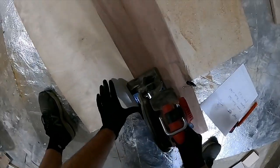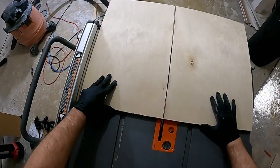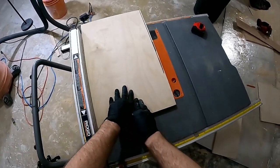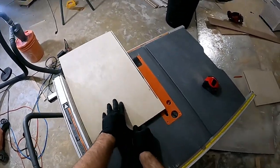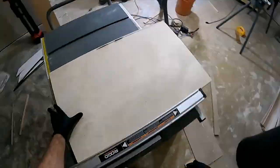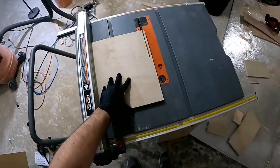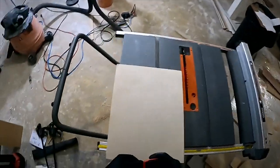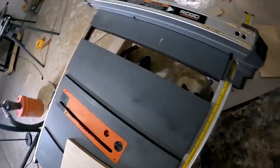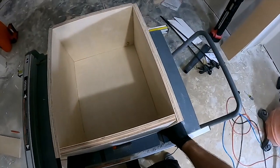Before I bought my track saw for cross cutting, I made a circular saw guide - check out the short I made about it, linked below. I used it to get close-ish chunks that I could then run more easily and accurately on the table saw. It's double the cutting but definitely better quality. My tools are not really cabinet-making grade tools, so I came up on these cuts twice - first to get pieces to a manageable size, second to get to exact. I don't have infeed tables or rollers, so I had to come up with creative ways to get longer pieces cut on the table saw.